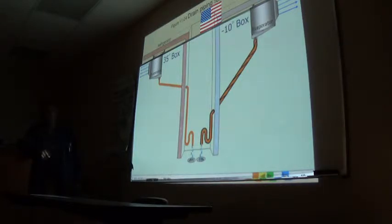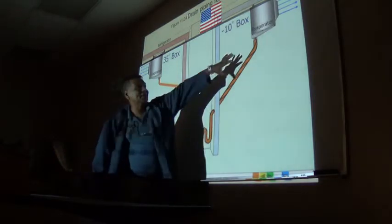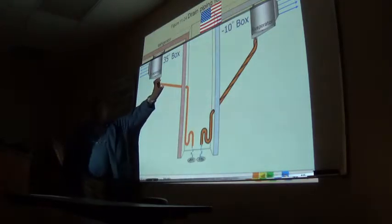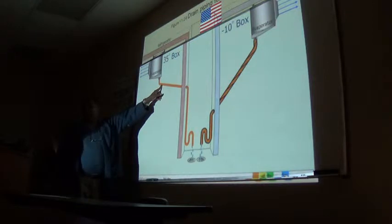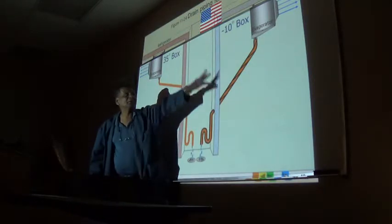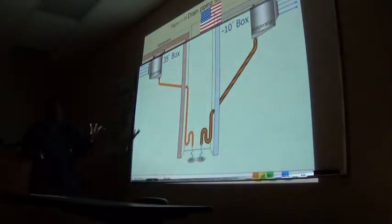This is not accurate there. We don't put that in here for a freezer. It's out here. This one, we can put it here or we can locate it here, because it's not freezing. This is not at freezing temperature, 45 degrees. That one is. And this more or less drains constantly. This only drains when we go into defrost, so it's not constant water flowing.